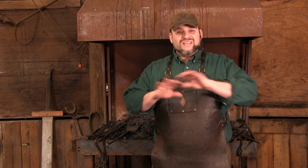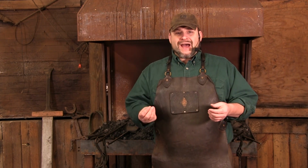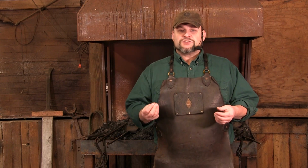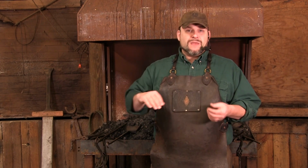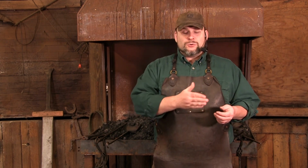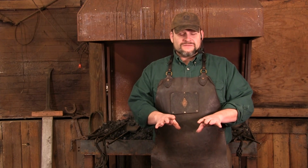Now, wrought iron was never liquid. It can't be poured. So basically, all the anvils were hammered together with several different pieces all mushed together into an anvil. Now, before 1840, it was just wrought iron, and wrought iron cannot be hardened. It's very, very soft. So a lot of these old anvils have a swayback, a literal dip that has been beaten into them. If you find an anvil that's had a dip beaten into it, for God's sakes, don't touch it. Buy it and put it in a place of honor. That is an antiquity that you do not need to deface, okay?